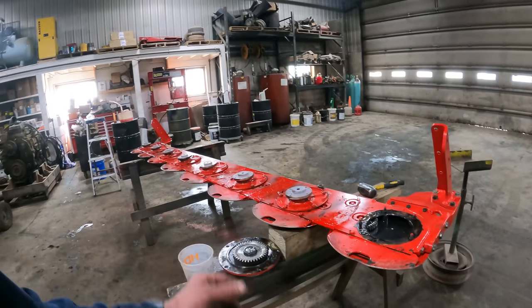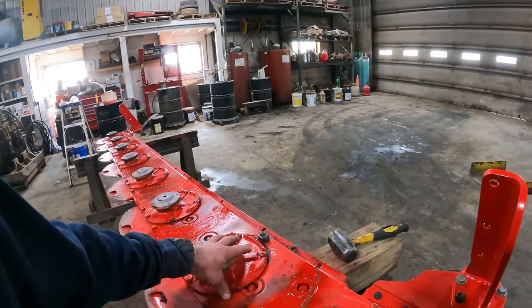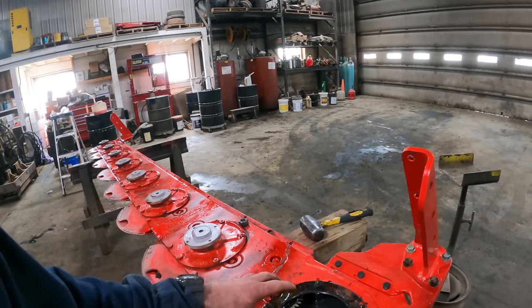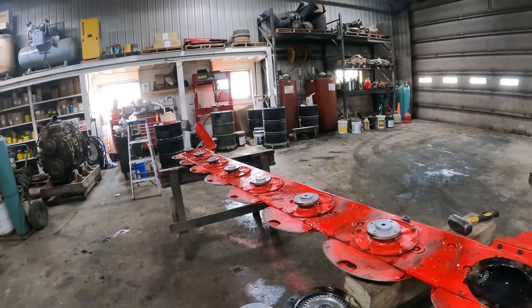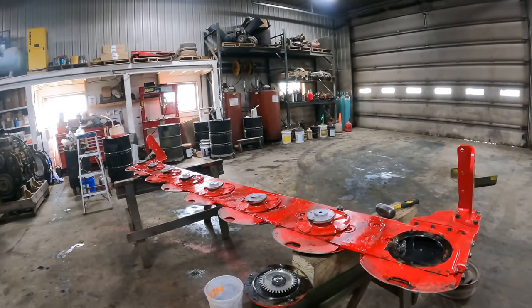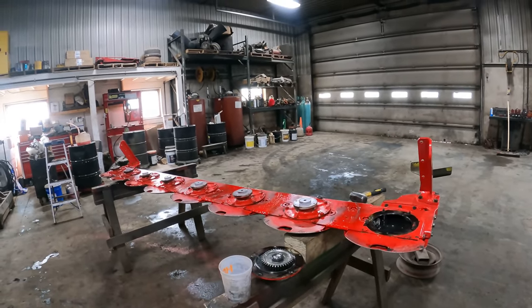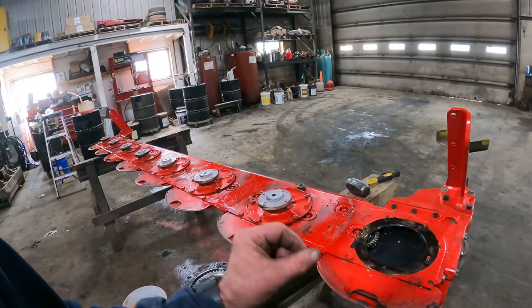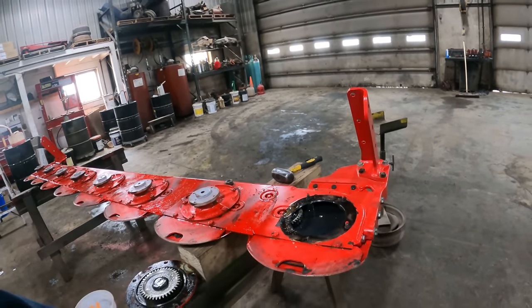We have left these outside before, and the trouble is water can get into the head. So you want to keep them inside under cover just so that you don't end up with any moisture inside that cutter head. So we'll go ahead and get the oil in there, and we'll put our spinner back on, and we'll join up with you when we get that done.